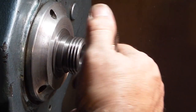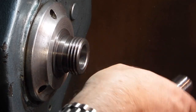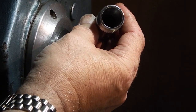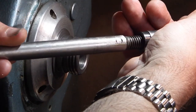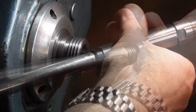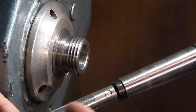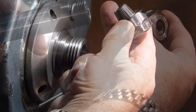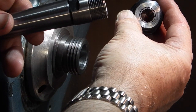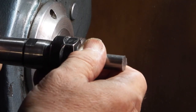The way I'm going to do this: there's a number three Morse Taper in the headstock, this is a number three Morse Taper on this adapter, and in this end it's an ER20 collet holder. The way I fit this in the end of the Morse Taper adapter, I'll screw in this rod. That limits you — you can't feed a rod straight through now because you've taken up the centre of your headstock. That's an ER20 collet with a half inch bore, which goes in there, and the rod will just slide in about 40mm sticking out, and this fits into the headstock.